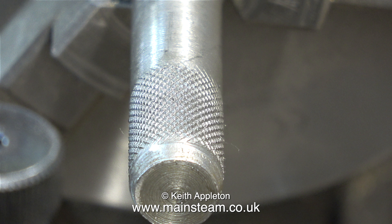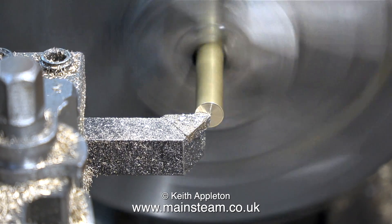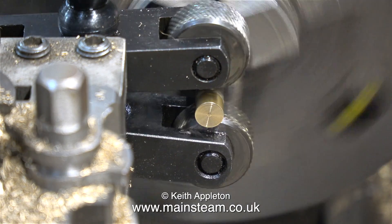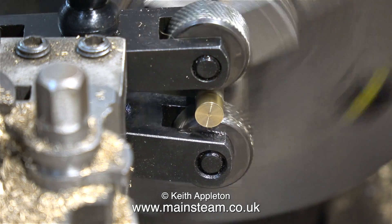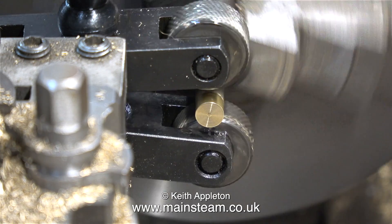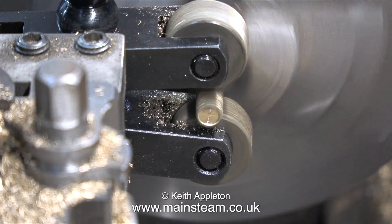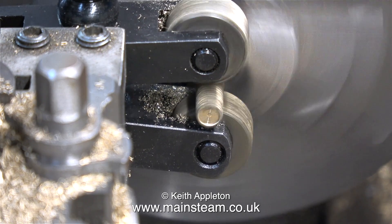This piece of steel is tough enough to stand it. So what if I want to cut a knurl on a piece of quarter-inch diameter brass bar? Here's one in the chuck — first of all I'm facing across the end. Once that's done I can move the cutting tool out of the way and clamp on the knurling tool. On smaller parts I could go a lot faster, but for the purposes of the video I put the lathe in back gear and ran it slowly. And as you can see it's still moving about, and very slowly the two knurling wheels cut the pattern of the knurl into the work. I soon got fed up of the job running slowly so I speeded it up, and here you can see the knurl appearing much quicker.